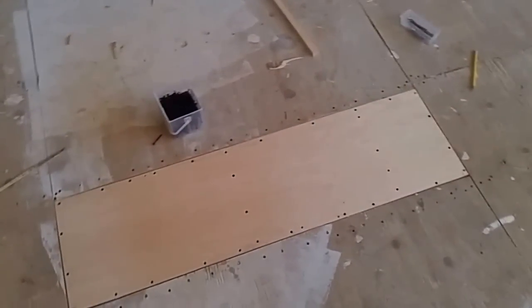Now this is with a new piece of plywood because that other plywood was cracked like I showed you. Over here, this plywood, like the flooring, was actually perfect. It was just the joist underneath was allowing the corner right here to sag down. So I was able to pop it up, and then I kept the tongue and groove on one end, and on the other end I cut the tongue off, and that allowed me to lay the board back down. But in this situation, I was able to reuse the wood I already had. So depending on what your situation is, you're able to make it work for whatever you need.